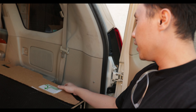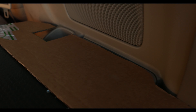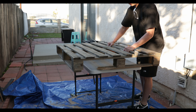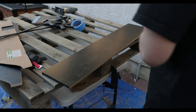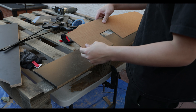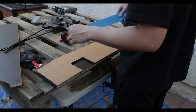So I finished making the template for the side pieces. I also made a cutout for the cup holders. Pretty stoked for that. I messed up on this side — I did it on the back side, but we'll figure that out when we start cutting. The next step is to trace this onto the piece, take out the jigsaw, and trim away. Before we trace it out, I'm going to put masking tape on the part I'm going to cut, with the bottom side on top, which means I need to put my template upside down.